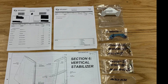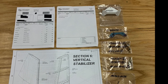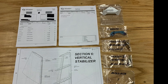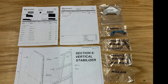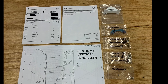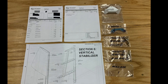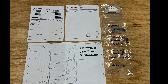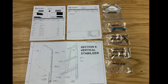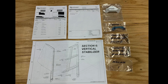One thing I'm curious about and will be keeping my eye on: when the vertical stabilizer is assembled to the tail cone, the heads of these number eight screws that attach this hinge bracket will not be accessible because of the rear bulkhead of the tail cone itself. I don't think you would need access to those screws, but I may do a little investigation and see if there's a new revision for that bulkhead that happens to have access holes in it for the heads of these screws. I could cut holes in mine — it shouldn't hurt anything — but that's a little ways down the road.